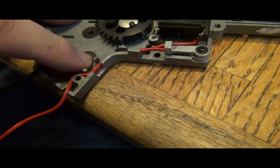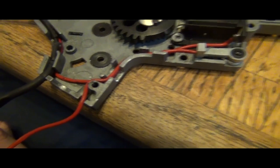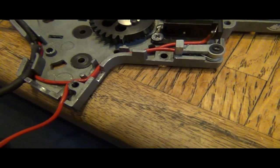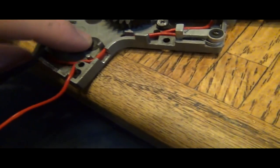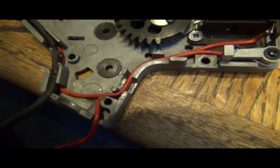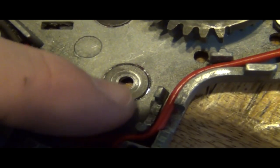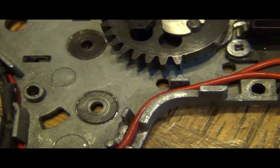The bushing right here has come up, and that could have been more a result of the power that the Lonex was pushing that bevel at, and started to try to pull it closer, and the amperage was going up because it's getting a little tighter for this type of reason. So this needs to actually be flushed back in, so I've got to pull that out and red thread lock it. It looks like the red has come out, probably because that bevel is spinning so fast by itself. So I'll go ahead and fix that.